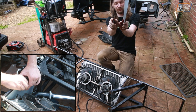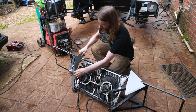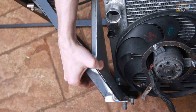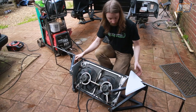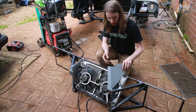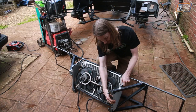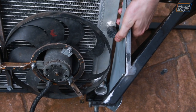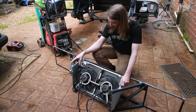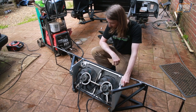We've got these two plates that are going to form the beginnings of our radiator duct. The bends are a little bit different from one side to the other — on the passenger side we can follow the inside line of the arm more closely, giving a really nice seal to hold all the air where we want it. On the other side though we've got the lower radiator hose at the bottom corner so we can't cut across as aggressively, meaning it runs a bit further back towards the outside of the front upright. They're pretty similar — close enough. We're going to get these tacked in, then remove the radiator so we don't harm it during the proper welds.